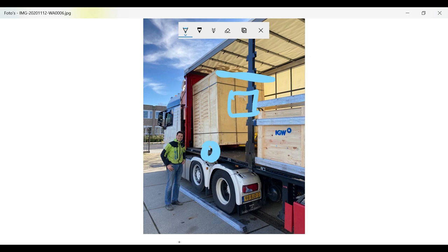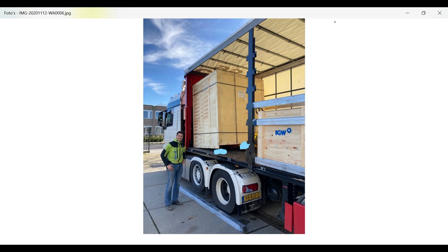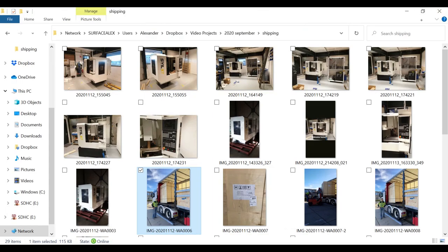This made it really difficult for us to get it out of the lorry. We had a forklift capable of lifting 2000 kilograms or 4000 pounds, but it was really a stretch because it was far out on the arms. So what we did was eventually lift up one side a bit and put in a beam underneath, then with the forklift lift it up a bit more and put in another beam. We were putting it on two beams and then could try to lift it out of the lorry. We first had to get it as close as possible to the edge without ramming the lorry, because then it was closer to the center of mass from the forklift. Then we tried to lift it and this happened — which was a complete, complete disaster.